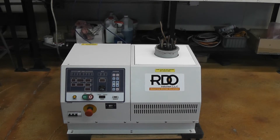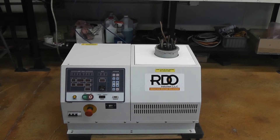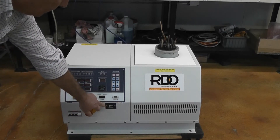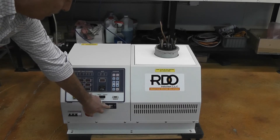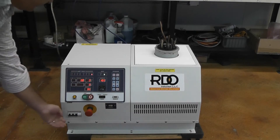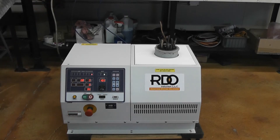Use of the machine is very, very simple. You load your crucible, load your metal — we're melting copper for this test. The first thing you do with the furnace after you have it plumbed and everything's ready to go and you have it wired to your electrical net, you'll turn your control switch on, which will turn your front screen on, and you'll turn your main breaker on.